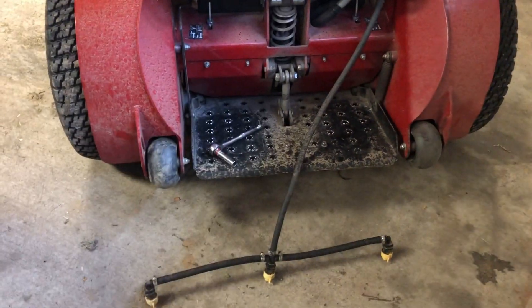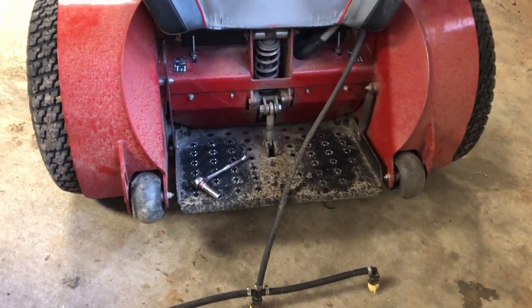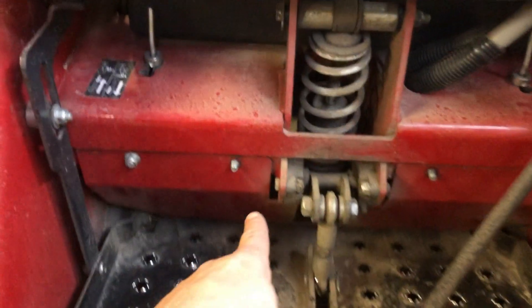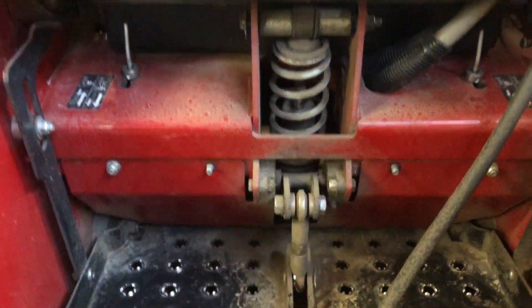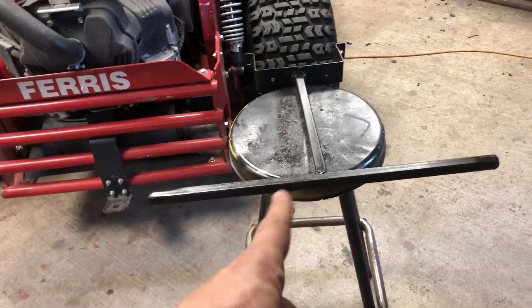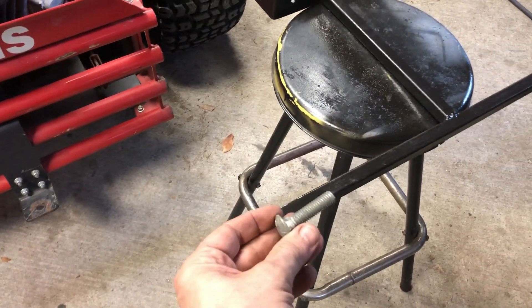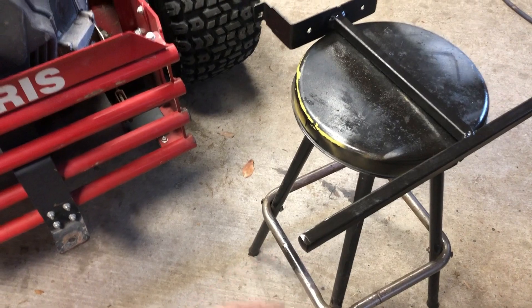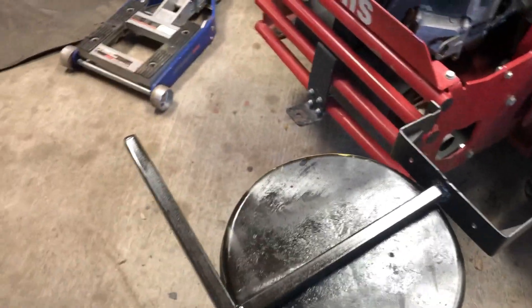So I just got the hose running, split off to three nozzles, and I just utilize these nuts right here on this little bracket I made. It's just three-quarter-inch square tubing — I took a carriage bolt, stuck it in there, welded around it, and ground it down so no water gets on the inside. It's all sealed up.